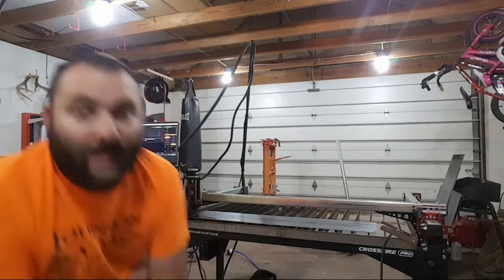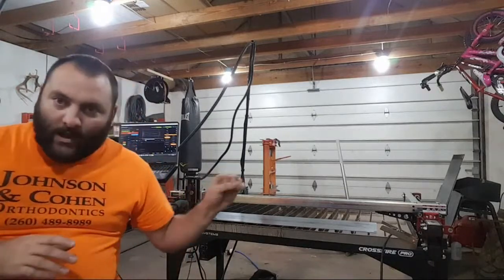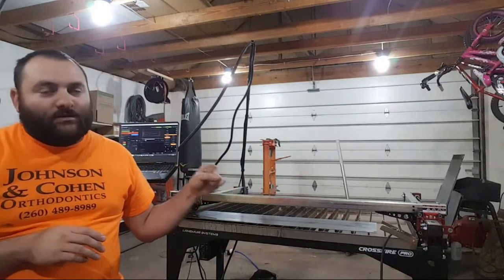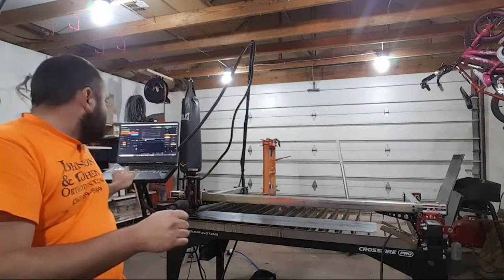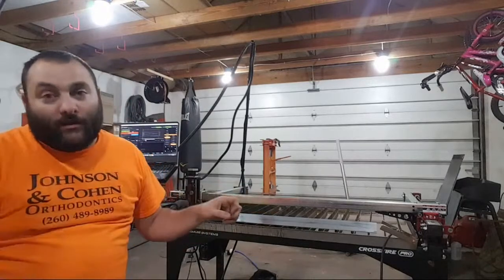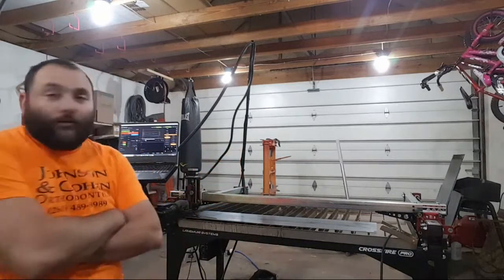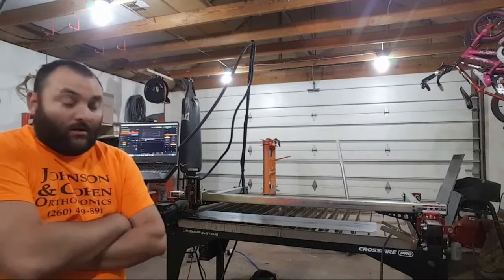Oh. Yeah, because I know that with low frequency EMI, like in the audio frequencies, you only ground one end of the shield. In the audio world, to eliminate EMI, you never ground both ends of a shield, because you can create a loop. But for higher frequency EMI, you totally ground both ends. So I don't know.